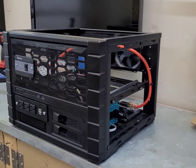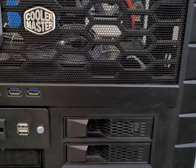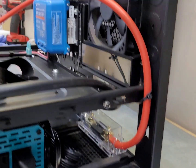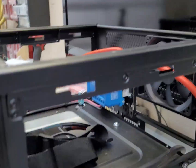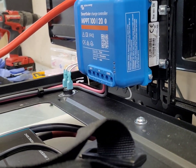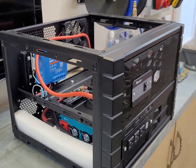Okay guys, that's pretty much it. As you can see, I got the inverter controller mounted here with the remote switch. I got the outlets and USB. I haven't done anything with the drive bays yet - these are removable and I'm not sure what I want to do with those. This is a 1000 watt Renogy inverter, pure sine wave - it works pretty good, it's good enough for what I need. I got the fuse mounted, charge controller, and the fan. The only thing I didn't get to do - I had ordered 10 gauge XT60 leads for a quick solar input connector but they didn't ship in time. Amazon back-ordered them, probably not going to be here for a couple more weeks, so I didn't want to wait on that. I'll add them when I get them, maybe I'll do a quick video on that. Otherwise, it's time to pack this thing up and do a couple of tests.